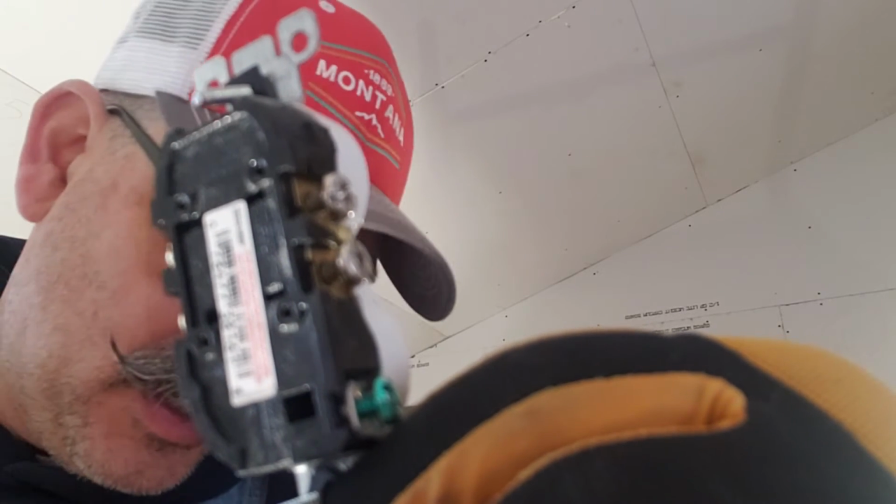All right, so this video is a specific request for somebody who's wiring a device up. And the question that came up initially was, could you use those holes in the back of the device, these right here, for your wiring connections? And they are made for wiring connections. They're made for a 14 gauge solid wire, so there's 4 of them there.